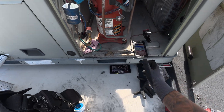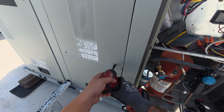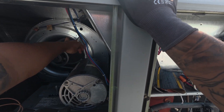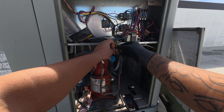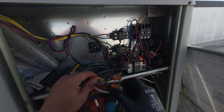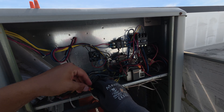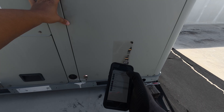Now that we got everything set up, we're just gonna let it do its thing. While I'm waiting for it to come back on, I'm gonna go ahead and check this blower, see how the belt looks. It says it's an AX-26 — you can barely see it written on there, but it looks good. I'll turn off the system, just doing this quickly. Belt seems good. What I can do is get my jumpers and jump out the stat right here. This is my fan, this is my 24V, this is my cooling, this is probably common, and this is my heat wire. Just put them all together — there we go — just to keep the system running, then put this panel back on to get some accurate readings.